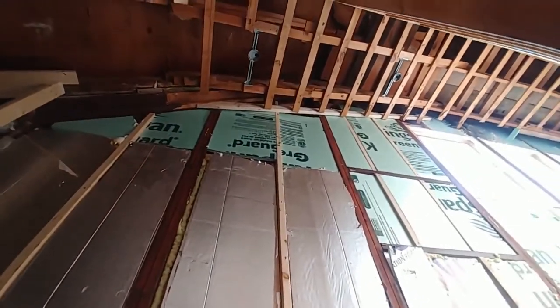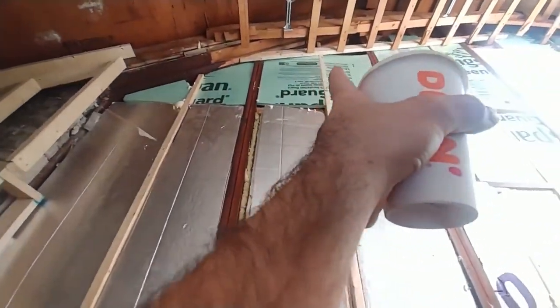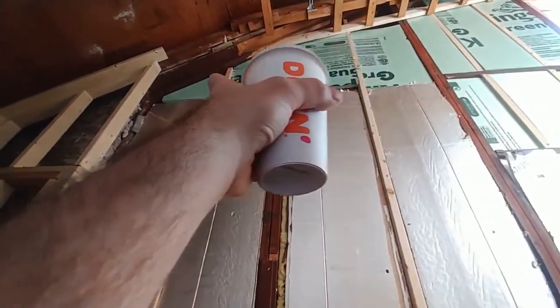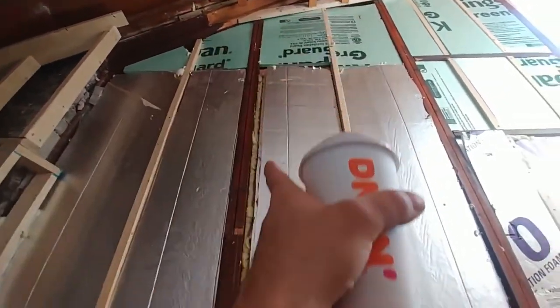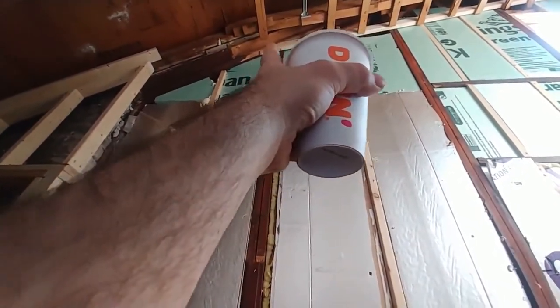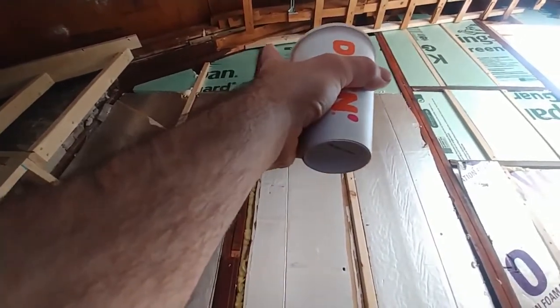We slid that ledger up there, that fresh white stick that catches the ends of all those furring strips. I set the laser up across the end of the furring strips and established a line over to where this framing, this red stuff, is part of how the front of this church was framed in. I got a line over to there, then I could put the T-bevel on there and grab that angle, then I could put that angle on the end of a stick.